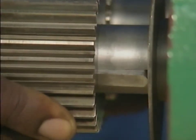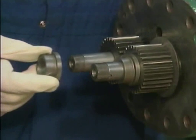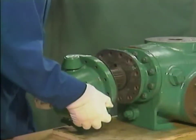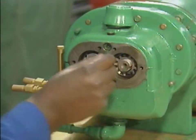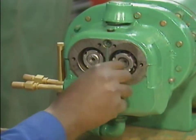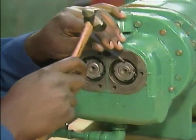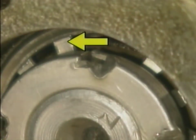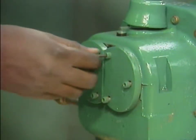After the timing gears are in place, the mechanic installs the spacer on each shaft. Next, he installs the bearings in the timing gear housing, then installs the timing gear housing with a new gasket. To secure the timing gears in position, the mechanic slips a lock washer into place against the spacer on each shaft and then finger-tightens a retaining nut against each lock washer. He uses a hammer and a pin punch to fully tighten both retaining nuts. An ear of each lock washer is folded against a groove in the edge of the corresponding retaining nut. After installing the timing gear housing plates, he tightens the set screws that hold them in place.